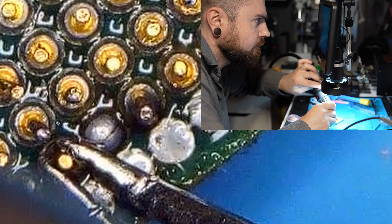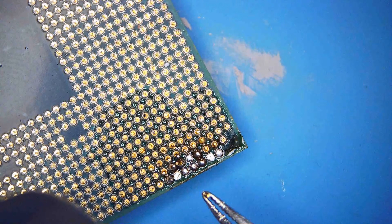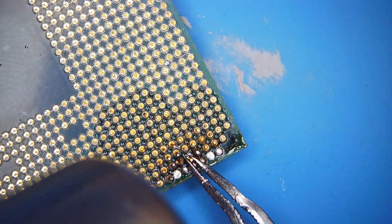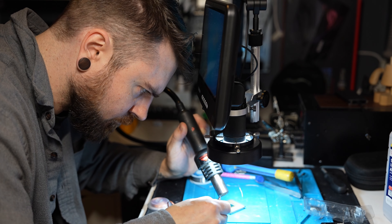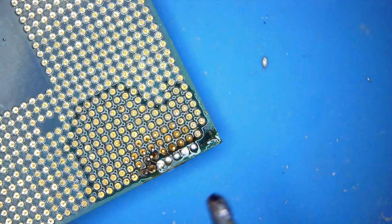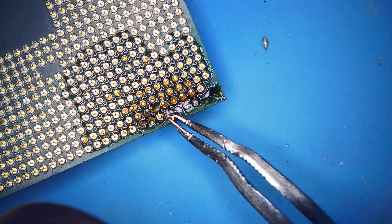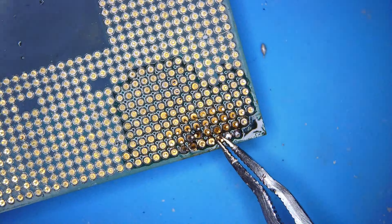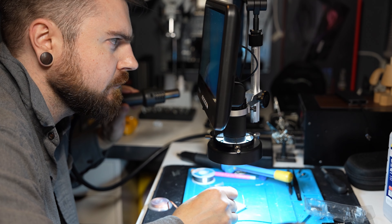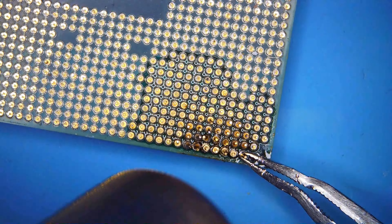You really have to hold it down and wait. One pin can take upwards of five minutes. Essentially what you've got to do: heat up the pad first with the soldering iron — dab the soldering iron on the pad — then use the heat gun. I found that about 380 degrees Celsius at about 50% power was perfect, though yours will vary depending on what model you have. At about 380 degrees I was able to heat up the pad just enough to put down the pin, then hold the pin in place for 10 to 15 seconds and pull the heat away. Leave it on there for a good 20 seconds, let it cool down, and then release your tweezers.